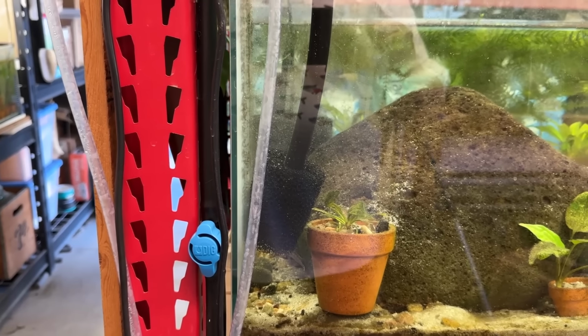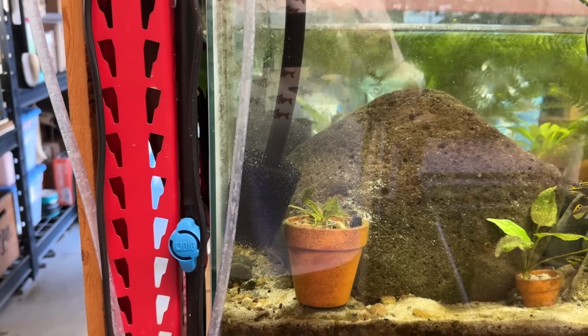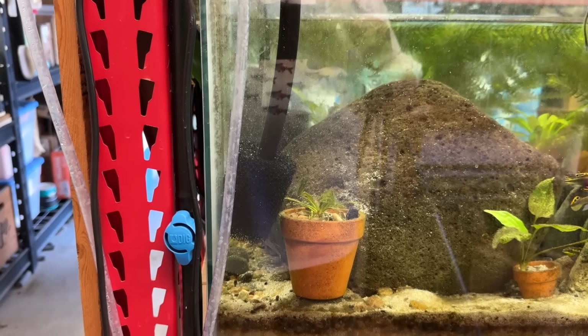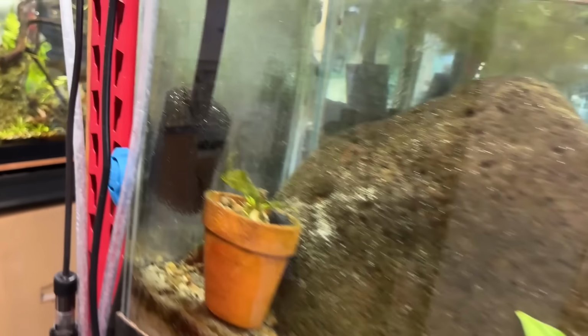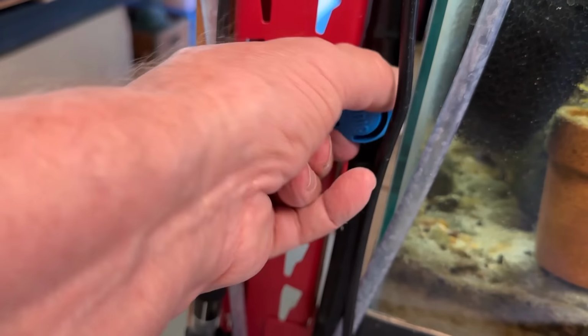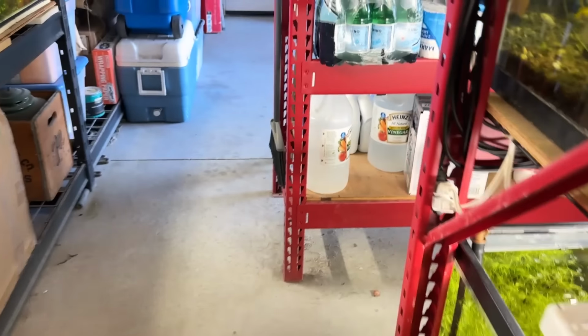And again, I didn't turn the volume up very high on the faucet outside. I don't want to blow anything apart. You've got to remember this is all drip. It's not made for high pressure. So probably at the most like 30 PSI. All right, this one's good. Now we can quarter turn. It's a ball valve, just a quarter turn.